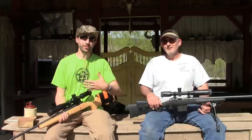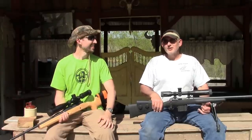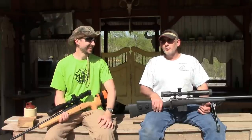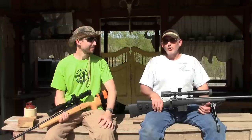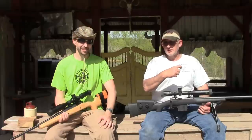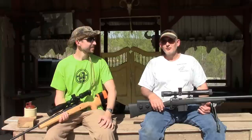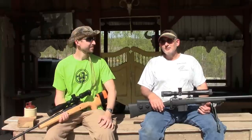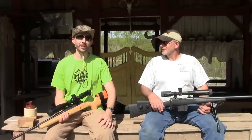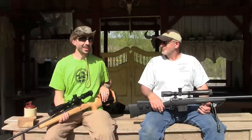It's 600 yards prone — so how'd it go? I actually did pretty good, until I had a mechanical failure. I had something going on with my primers — there were burning holes through them. My extractor stopped grabbing and the case got stuck. I couldn't figure out what was going on, so I had to call it quits. But I think I did pretty good — I got a couple of bulls out of it. It sounded like the shooting itself was going well. We'll have to get a close-up of the bolt face because it's pretty etched.